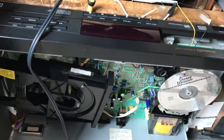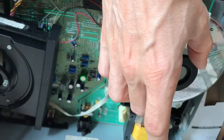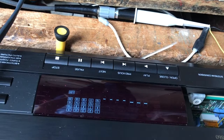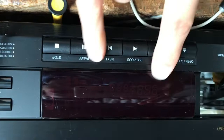It worked with this transport and then it didn't work anymore. My boy bought a 30-buck CD player, took out the CDM, put it in the car navigation and now it works perfectly. But I'd like to know what's wrong with the original. I measured the laser power and it's good. So let's turn it on - and almost immediately it shows error. These Philips players have a built-in service menu accessed by pressing two buttons while switching on.